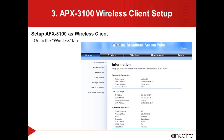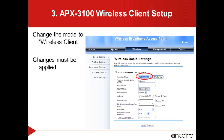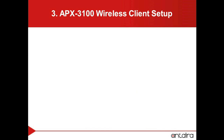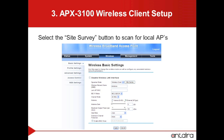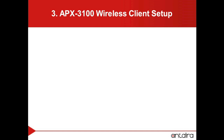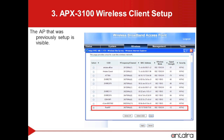To set up the unit as a wireless client, we will go to the Wireless tab. As default, the operation mode will be Access Point. We will want to change this to Wireless Client and then select the Apply button to finalize the change. When the unit is set up as a wireless client, we will want to select the Site Survey button to look for local access points. Here we can see the list of all the local access points to our client device. On the list is the ROOP AP that we had previously set up. We will want to select the Select AP button.